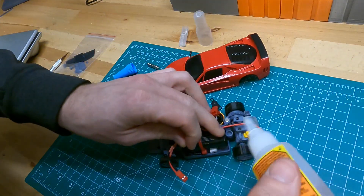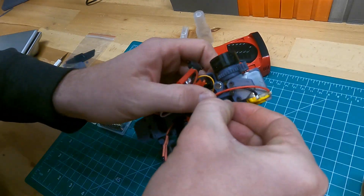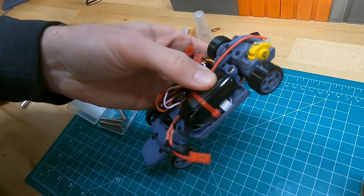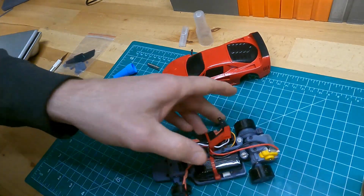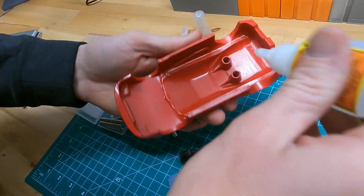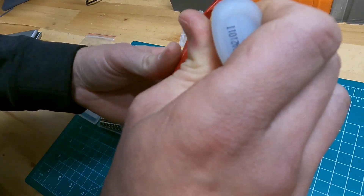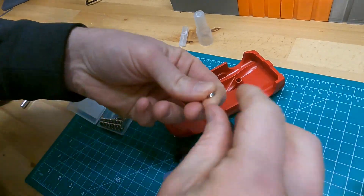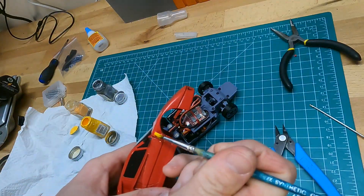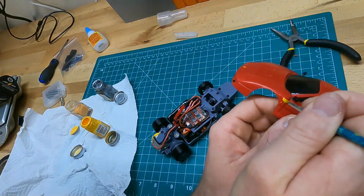Okay, now we can put in these magnets — again just a little dab of CA glue in there, slide our magnet into place and it slides nicely into the little hole, squeeze it in all the way. Get the other one in and then we'll make sure these go on the right way. Note: I'm actually using the wrong kind of glue here for the magnets on the body and I ended up having to redo this later with a thicker glue like epoxy, because the designer made the holes a bit too big for the magnet and you really need a glue that can fill some space so the magnet can be held flush with the opening of the hole.